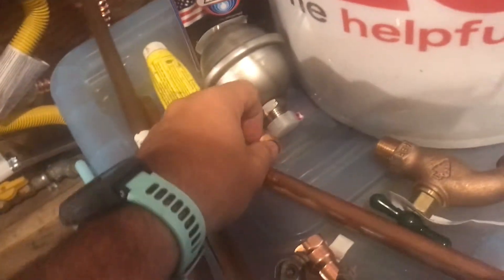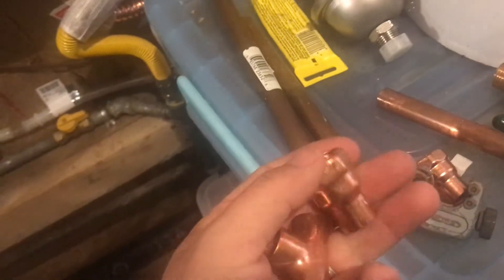What I'm going to do is install a tee — I bought the connection, it's a half inch. I'll install the tee line and a little extension. I found a piece of scrap pipe I'm going to use. I'm not going to cut it first because it's easier to have a long pipe to do the soldering, then attach this piece at the end and do the cutting after.